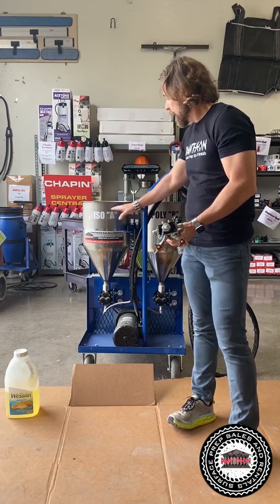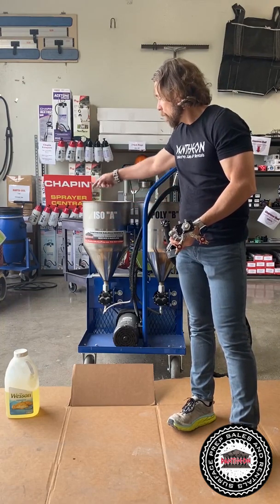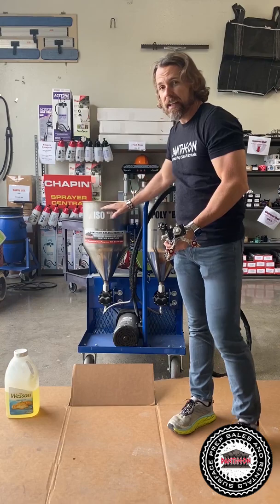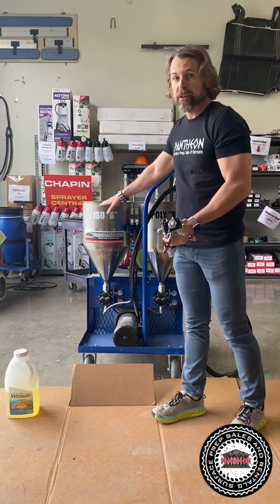You don't wanna leave air in the ISO side, because if you do, you're gonna get rings. And those rings with air, they'll cure out and they'll just become a headache for you. So you always wanna bring the A, and I always bring the B up too, okay? So I bring my A and B up, fill my material up.